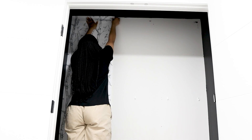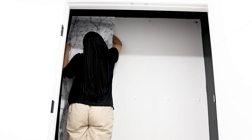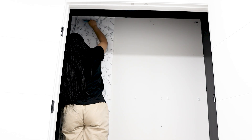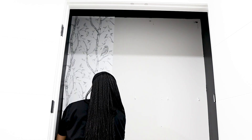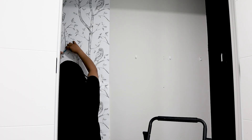When I was done and made sure that everything was in sync, I went ahead and started applying them. These are peel-and-stick wallpaper, so all you have to do is peel them and stick them to the wall. My technique is to peel as I go while using my hands and a smoother to make sure that there are no air bubbles trapped in the paper.